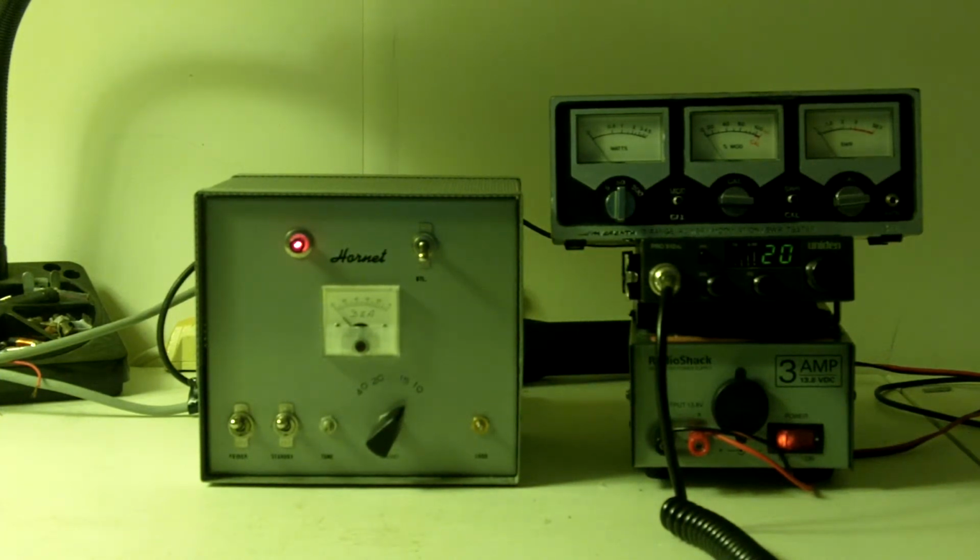This amp's been restored. It has new filter capacitors. Someone overdrove this amp. CBers are bad about doing that. In this case, the person had put too much power into it and they'd burned up the choke going to the king tube. People think they can dead key one and swing 30 or something and get away with it. Well, you can't. You'll burn it up. Even if you're overdriving with dead key, or overdriving it with swing, you're still overdriving it and you'll still eventually blow it up.